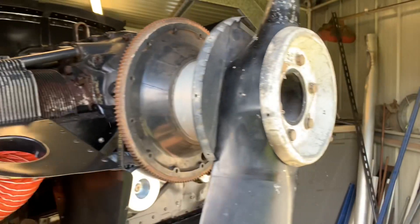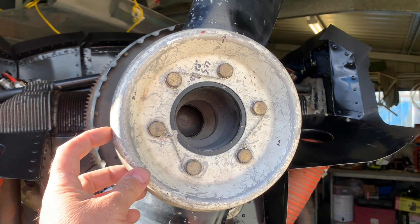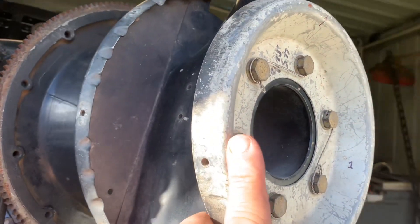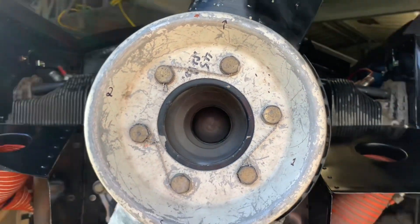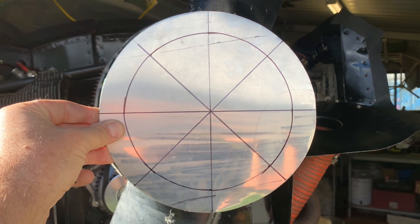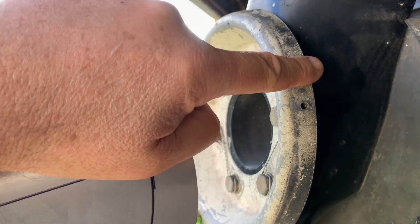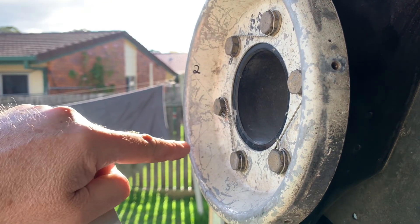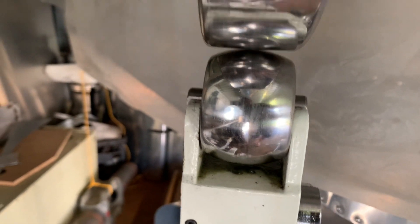This bit here is the challenge — to try and get it centered and all of that. I've only got the English wheel over there, so I can't spin one up on a metal lathe or anything like that. We're just going to have a go. First thing I needed was the dimension of that edge from there to there — it's tapered, see? So we want to measure from there. It's a bit difficult, but I guesstimated and came up with a plate like that. I just drew some lines in there to help me keep in the center. We need to make that fit that edge, so we want this skin to touch this edge and then dome from there. We're just going to use the English wheel — I don't want to shrink anything because that'll leave marks, so we're just going to use the sharpest die I have and go for it.